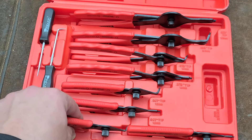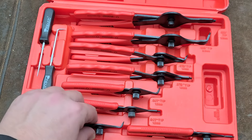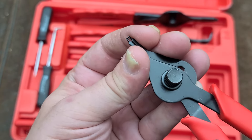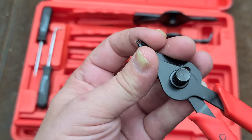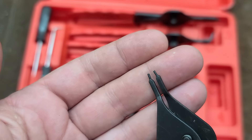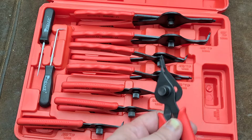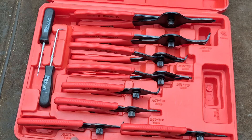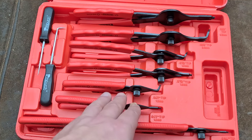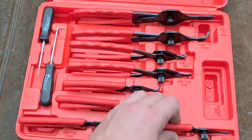That's actually one of the things missing with all of Harbor Freight's new expensive sets — simple additions like picks. With the sharp-tip ones, so many times the eyes are obfuscated. Sometimes fairly large snap rings have slightly undersized eyes, and that's really what happens with these tiny ones. These are really for tiny snap rings, and people always end up using them on too-big rings and bending or breaking the tips. Harbor Freight includes both the 36 and 47 thousandths pins, whereas most sets just include one or the other — giving you two small sizes for a better chance of not bending the tips.